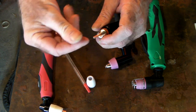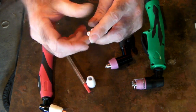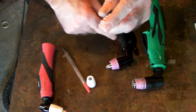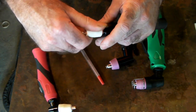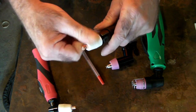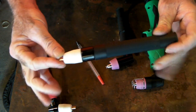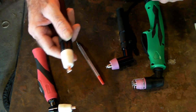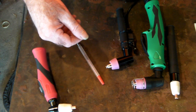I like the double-ended electrode because you wear out one end, spin it over, and do it again — it's a really brilliant idea. They're cheap as chips to buy. I've actually converted my machine — it originally came with an AG60-style torch and I converted it to the PT31 because we don't have a lot of choice for where to buy consumables here in New Zealand.